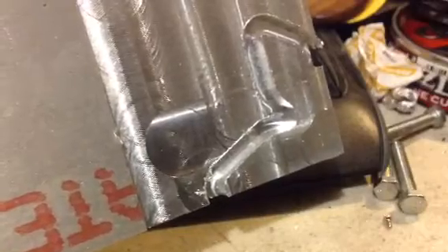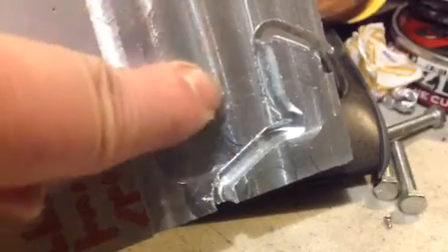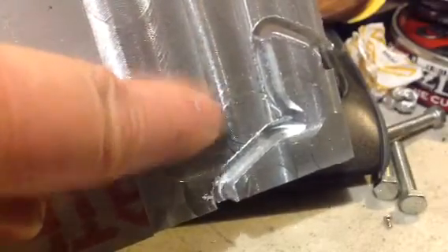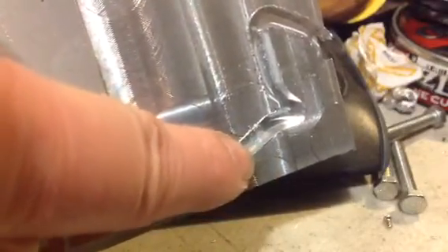I didn't even think about it — I do have a one-inch American-made end mill, and a one-and-a-half inch. I'm going to use the one-inch end mill to take the face down and that'll clean up and not leave this crappy finish on it, and then I'll use the other one I'm going to order from eBay and knock that out.